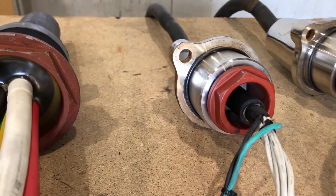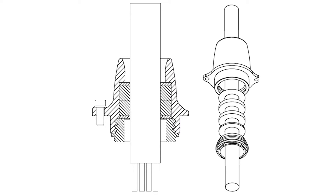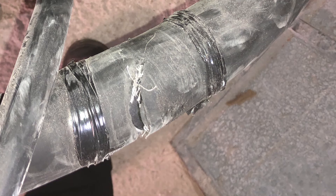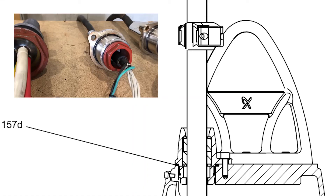The cable clamp is compressing the rubber bushings between the two truss washers, thereby making a sealing between the cable and the stainless steel housing. The two-component epoxy filling makes an additional sealing in case the rubber surface of the cables has been scratched and water is entering into the cable. The complete cable inlet unit is installed onto the pump, and the sealing between the cable inlet unit and the pump is taken care of by an O-ring.